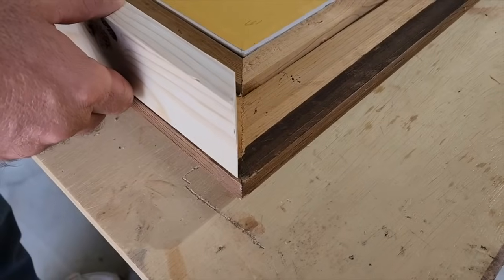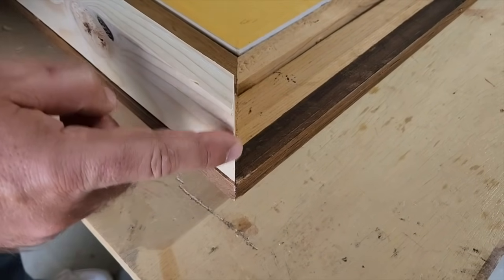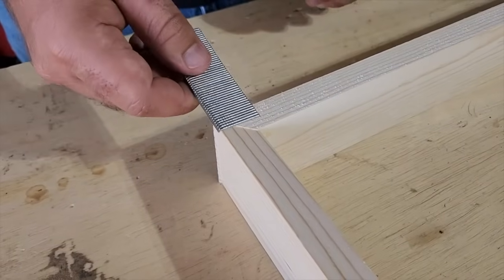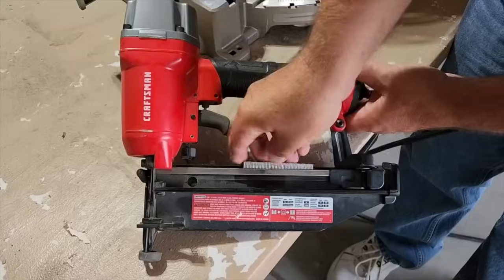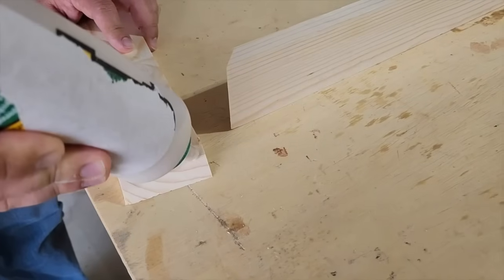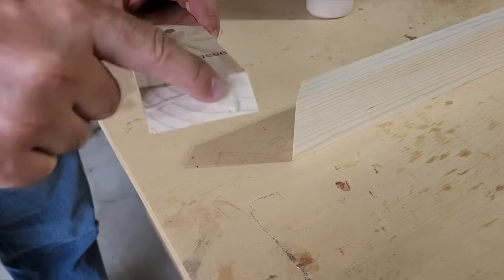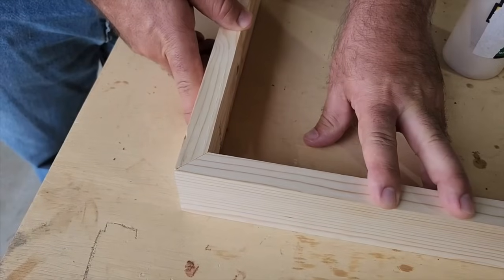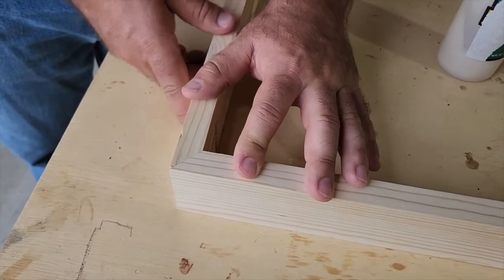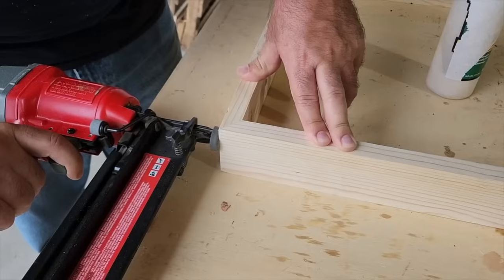Remember, we've got to cut two pieces. Once you get them cut, check to make sure they're a nice 45 degrees all the way around. Now it's time for the nails — I love using air guns, so the nails just need to be long enough to go through. Load them in the gun and put some glue on all the ends. Nails work great, but the glue is also going to make it strong. Put all the corners together and, as you can see, they line up really nicely — especially if you cut them right in the beginning.